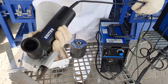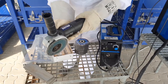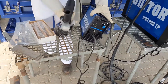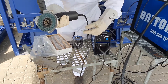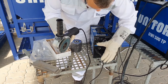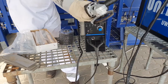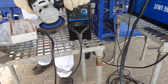I would like to demonstrate one option to utilize a safe grinder which is only 42 volts, connected to any kind of unit inverters marked TP version. In our case, we use the smallest machine — the grinder is connected to the welding outlets, polarity doesn't matter. You select TIG — better to use TIG in our case — you put maximum amperage, and you switch on the machine so you can operate the grinder.